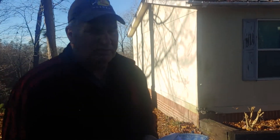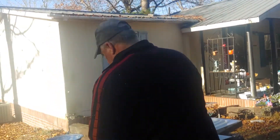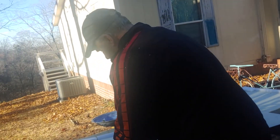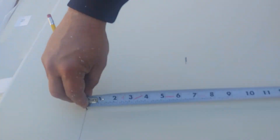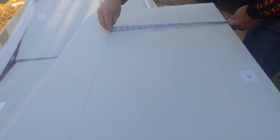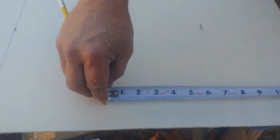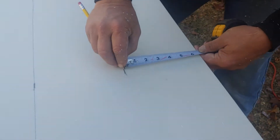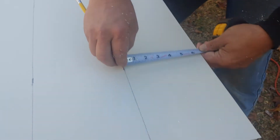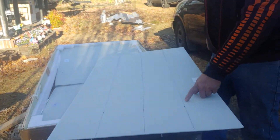Then you put beads of adhesive — should be two inches apart, but no closer than one inch from the panel edge. Put circles in between the tape sections. That's what we're going to do next. I'm going to mark where to put the tape. You can make marks on both ends and pop lines or use a straight edge. This is very similar to what you would do on drywall.